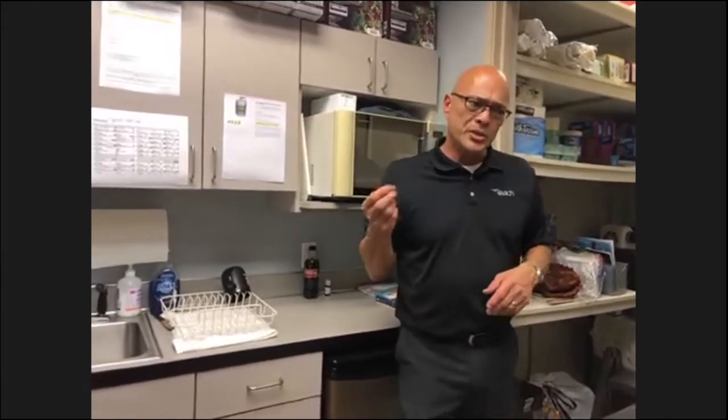You only want to run it typically twice a week, versus the detergent cleaners, which are recommended every day at the end of the day. With the live enzyme cleaner, you want that live enzyme to stay in the line, so you're only going to be doing that twice a week. And there is also a liquid if you want to flush out the system after a surgery. So it does a couple of things. It keeps your main line clean.